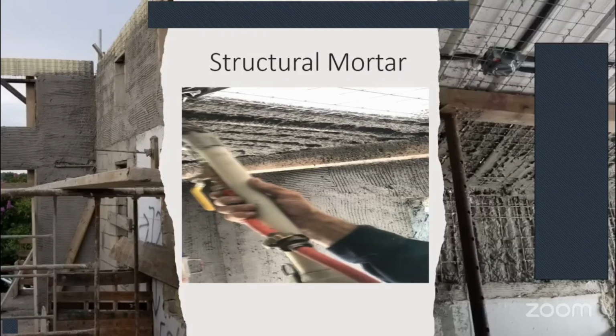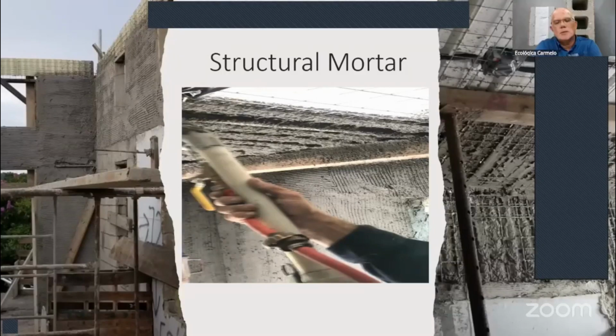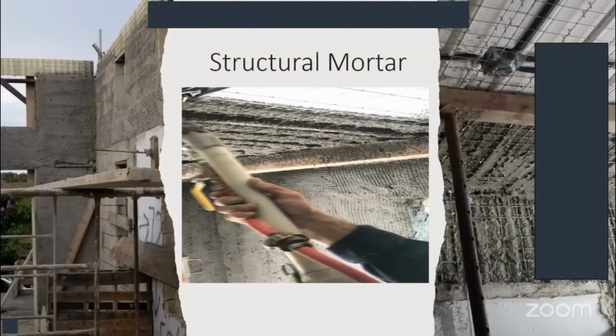So then you absolutely have to have the 4,000 psi concrete 3/4 of an inch over the wire mesh. That is correct. And then you can put a finishing concrete or silicone or whatever kind of coating you want after that. Okay, got it. The same thing with the walls. Probably what a guy would do, with those plastic pipes, is spray your mortar on till you get a little bit over that, then screed it, and then put your scratches in there afterwards so that you can apply your finishing coat afterwards. Is that correct? Yeah, on the walls, you can finish it all the way up to the outer side of that pipe, which already has the 3/4 over the mesh.